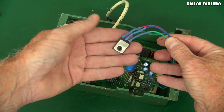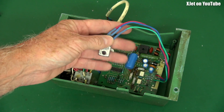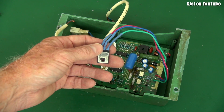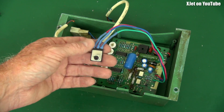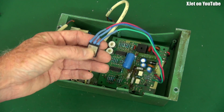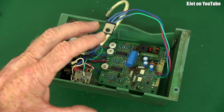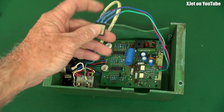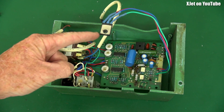Here is the main FET. This is the thing that switches the power to the motor off and on. It's a pulse width modulation speed controller, which means it gives little bursts of power — a pulse — and to go more power you have a wider pulse, and with less power a narrower pulse. It's a pretty simple, common way to control DC motors, because this has a DC motor in it — not a brushless AC motor, a DC motor. This FET can handle lots of amps and lots of volts, no problem, and it's in series with the motor.